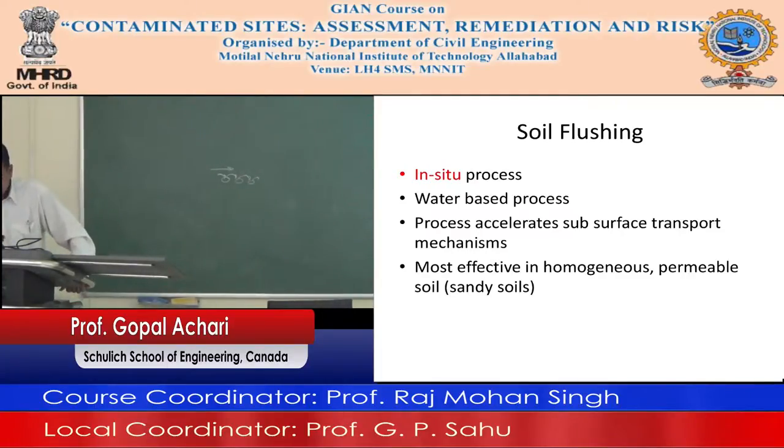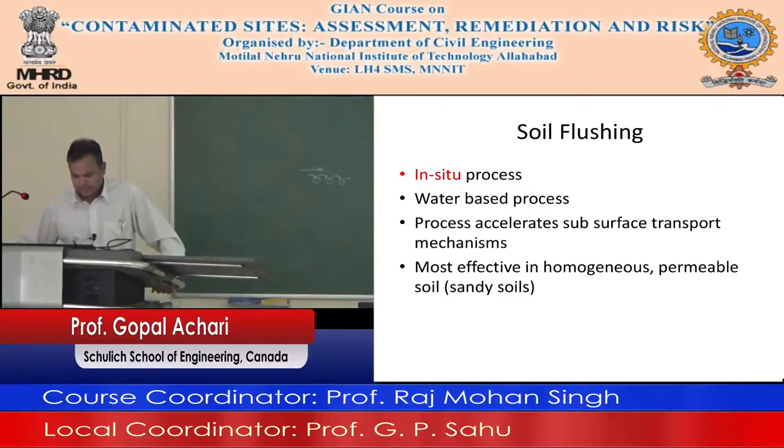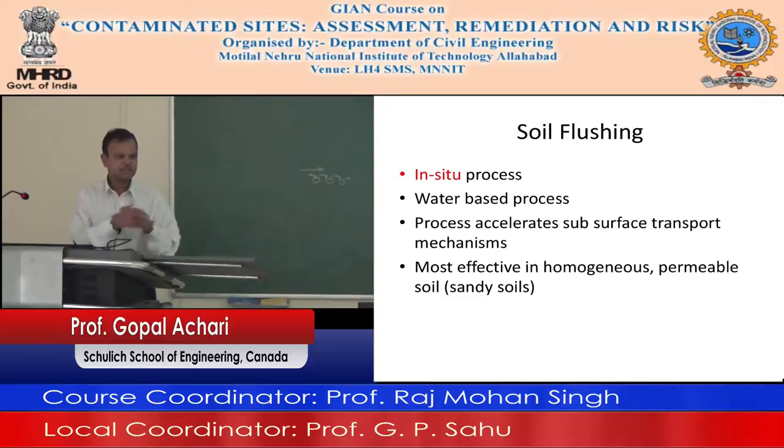So, transport mechanisms, advection, dispersion, we don't need the M here. The contaminant applicability for soil flushing has to be highly soluble and very low interfacial tension, because you want the contaminant to be able to come out. If you have salt, for example, you flush water, the salt will come out, dissolve in the water and go. You don't want something that is sticking to the soil, you would be unable to take it out because you don't have the ability to mix it in the soil surface, right?